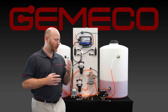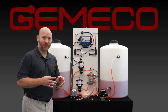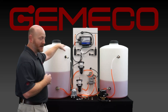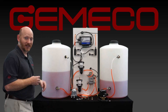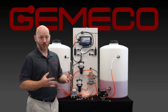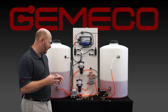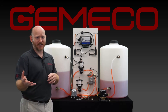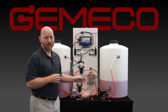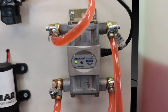So behind me, we've actually constructed a visualization of what a diesel flow system is going to be like on a boat. We have our diesel tanks with simulated diesel fuel in those tanks, and some generic pumps to simulate both supply and return. On a diesel engine you're going to have one output, which is both supply and return, but for demonstration purposes we're running two pumps to simulate that supply and return feed to our diesel flow meter.